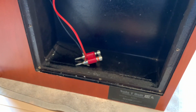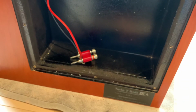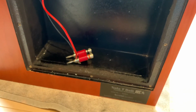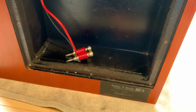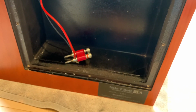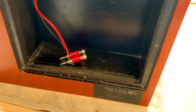And usually if you've been into audio for a long while, you probably have an extra set of amplifiers lying around, and just find a pair which has the highest power output. If it doesn't have a good top end, don't worry about it, because it will be only used for the low frequencies. And then have someone build a crossover at the input stage, so that the high frequency signals are attenuated when they reach the unit, and do not use a crossover at the output side of that amplifier, and then just connect it directly to your subwoofer.